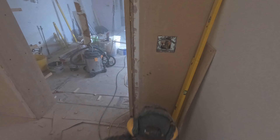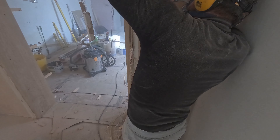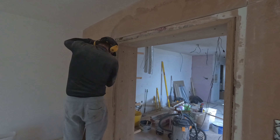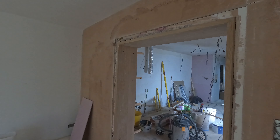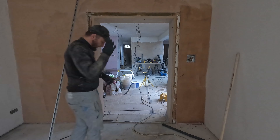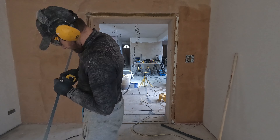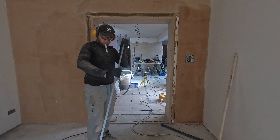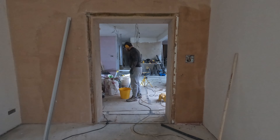I am cutting out a 100mm strip all around the frame to create the space for the plasterboard installation. As you see, the plasterboard has the stop bead installed already. Now it has to go into the space around the frame. I am using the drywall adhesive to install it. You need to use scrim tape on the joints to prevent cracking.